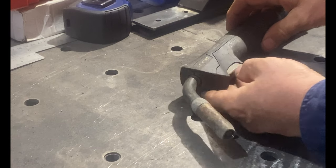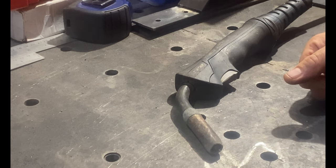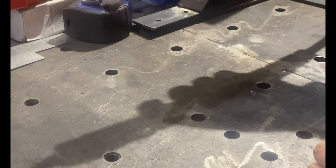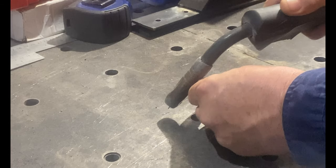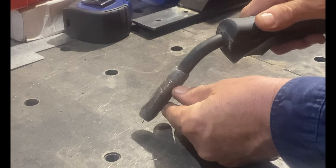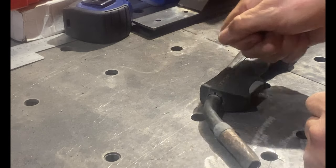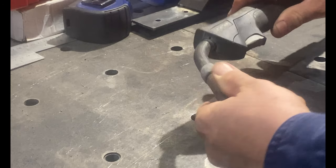I've encouraged you to seek YouTube videos on welding for better training, but what you may not find on those videos are the problems you'll encounter. This is specific to our MIG welder. The great advantage of a MIG welder over a stick welder is that you only have to build muscle memory for one axis — your horizontal — because the wire constantly feeds. You only have to maintain one distance, roughly 10 to 15 millimeters. With a stick welder you have to become proficient at two axes as the electrode is consumed.